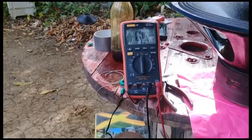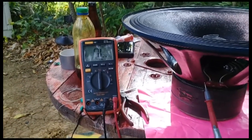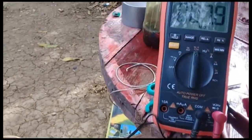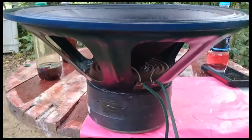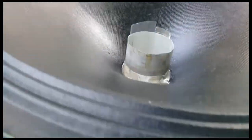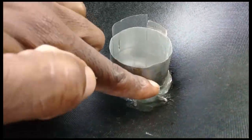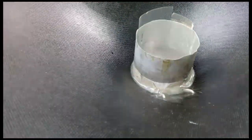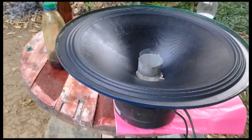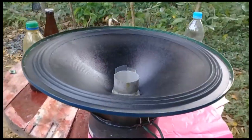Going to take a play on a 2000-watt QSC amp. 6.8 ohms — not too bad. The lead wire is on, epoxy is up. Going to cut the coil a little shorter, then run some tests — put some signal to it and see how it sounds without the box.